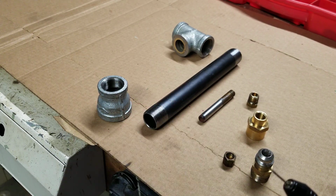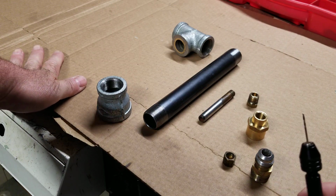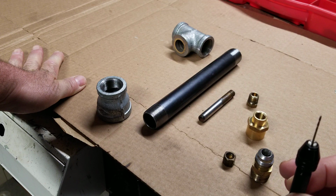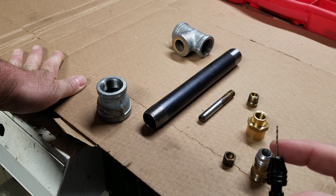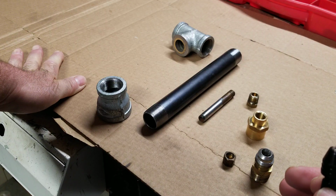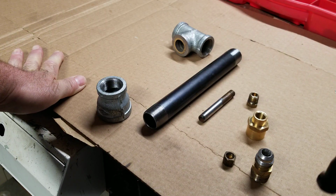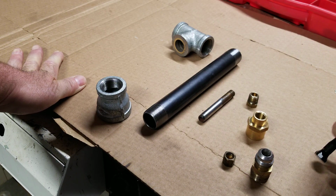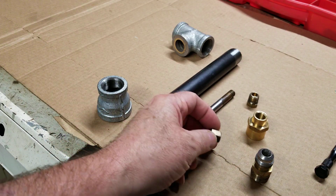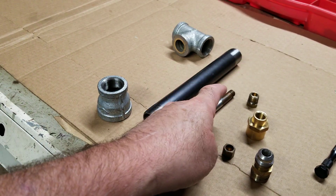If this drill will fit in your drill press, it's much easier, but your drill press has got to be dead square, obviously, and capable of holding this little tiny fine drill. And when you pull down on the handle, it's so light with it, you actually got to listen to it cutting. So either way, you're going to have to get a nozzle or make it out of a MIG tip and just change some of the plumbing here.